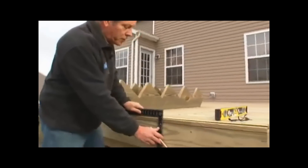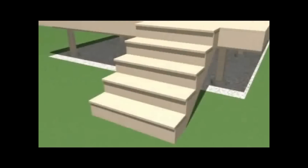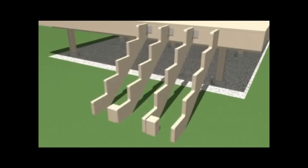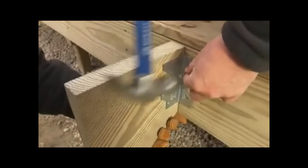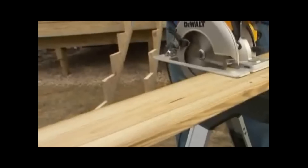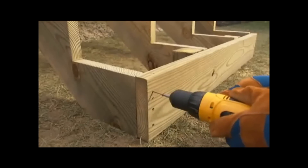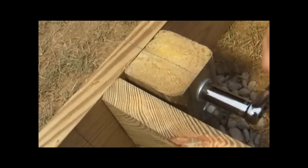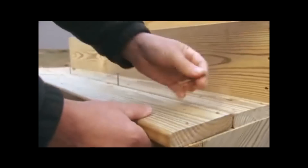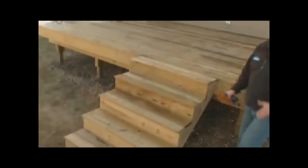Start assembling the stairs. Following your building code, mark on the joist where the steps will attach to the deck. Our stairs will be 48 inches wide, supported at the deck with brackets and at the bottom step with posts. Secure the stringers to the deck flush with the top of the joist, and conceal the brackets by attaching them to the inside of the steps. Cut all the toe kicks and treads at once to save time, attach all the toe kicks with screws, then use carriage bolts for the posts just as you did with the beams. Attach the treads leaving a drainage space, similar to the decking.